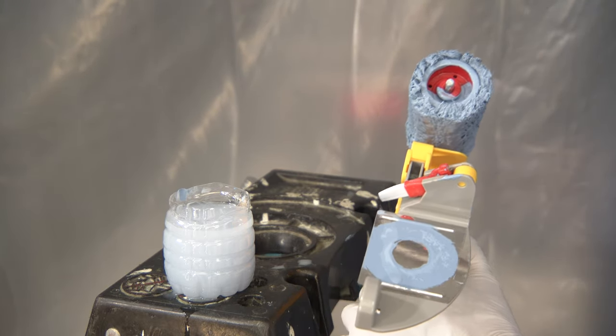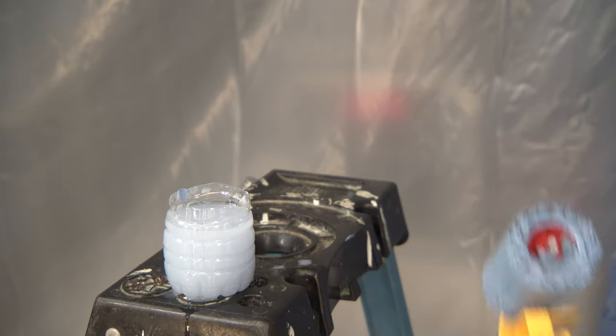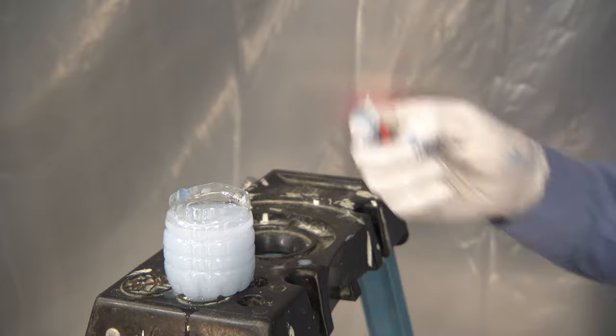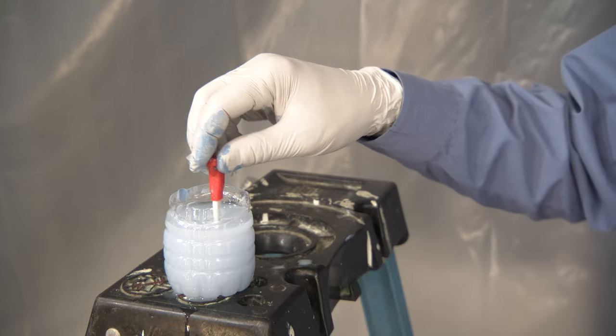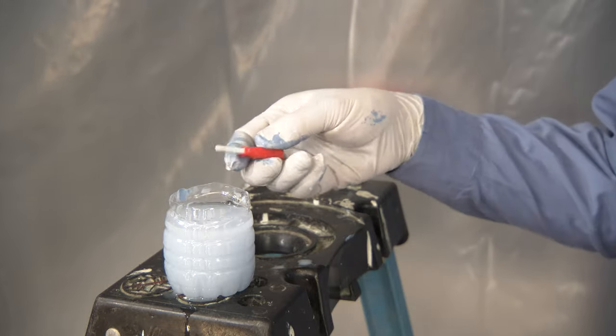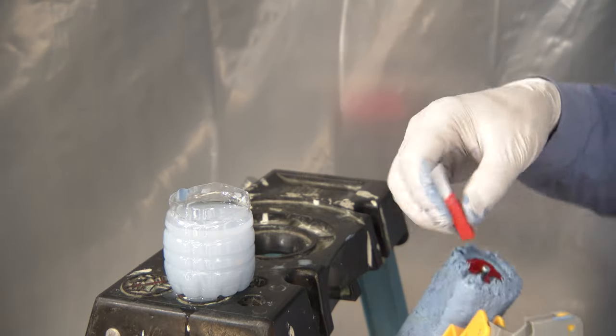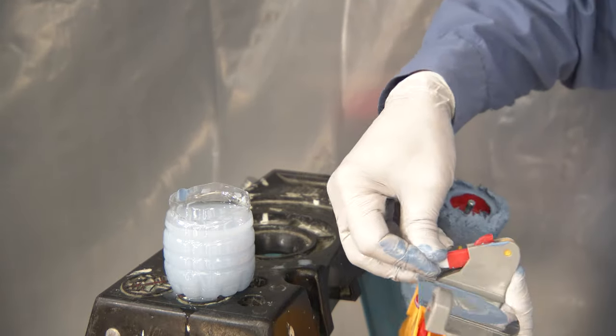Don't worry about it if it's wet — if it's wet, that actually helps the paint flow and sometimes it'll make your line a little bit cleaner. If you're having trouble with the paint getting dry on the brush and you're getting globs along the edge, take the paint brush, swish it out, get rid of any buildup of paint on the brush, and then stick it back into the edger and you're good to go.